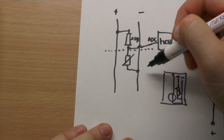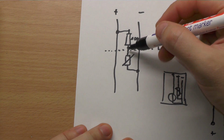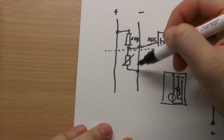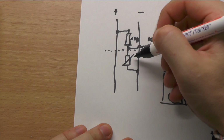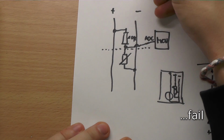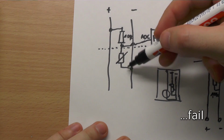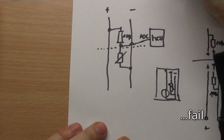So if the battery is getting hotter and hotter, we get a lower voltage there, and if the battery gets cooler and cooler, we get a higher voltage. Since this is something like, okay, this is our slider, and we say we have 10K here and 10K here. We have someone between 0 and, let's say, this is falling to our 3.7. So maybe you have to put the regulator in between to get 3.3, but this is something for now. And you say, okay, since this is connected to this resistor, connected to ground, this is our varying resistor with temperature, and this is our fixed resistor. So this ratio of them is showing what you get.